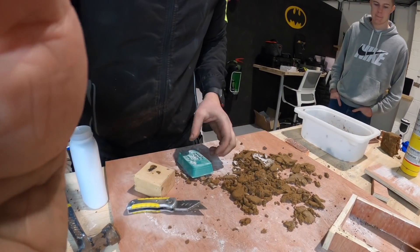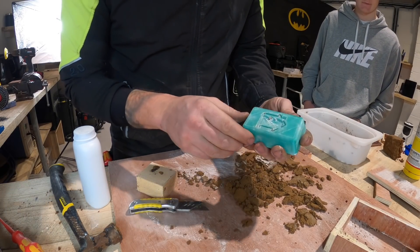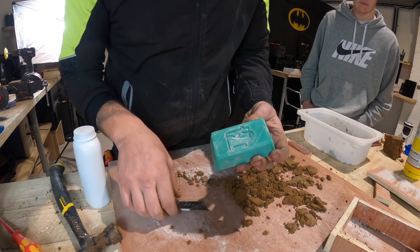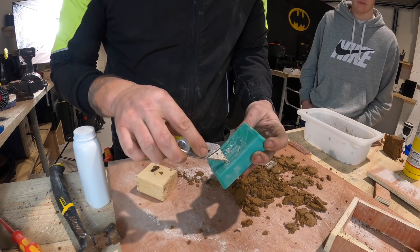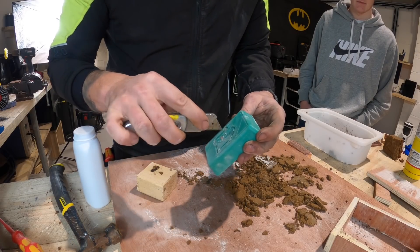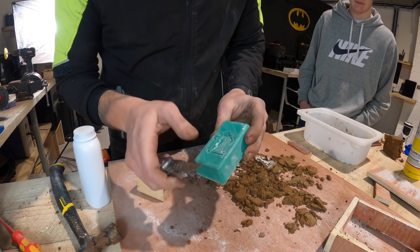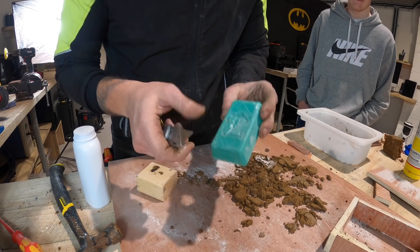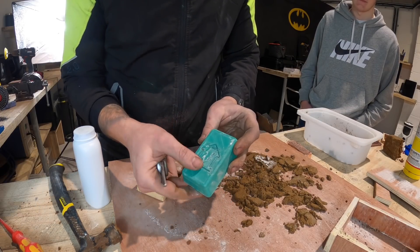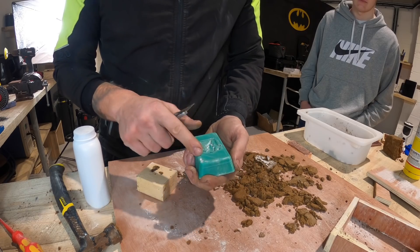Sorry, my SD card was full. What I've been trying to do is heat up some sand and smush it in to see if it leaves an imprint. I've sort of come to the conclusion that these channels are just too small — all the sand gets stuck in it. I can't really get the talc in there enough, and if I do, it fills the channels up and then we don't get an imprint. I'll give it a few more shots but I think the channels need to be thicker. The lightning bolt is working out brilliantly, but the small channels around the house itself isn't working.